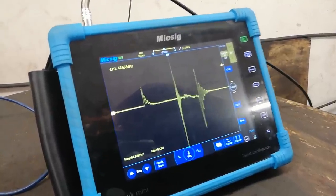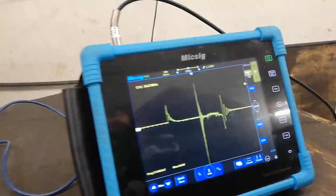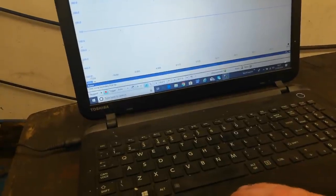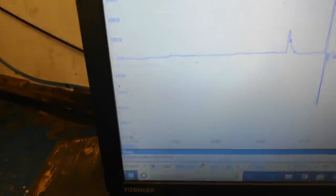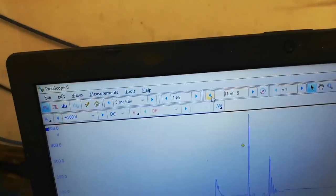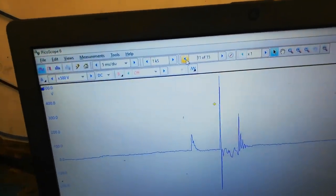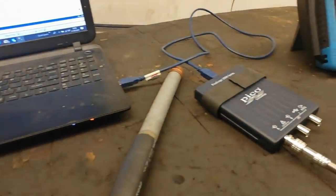It's all in one volt there and it's just measuring 4.6 volts. That's a good capture. The wee pattern was a wee bit jumpy but we'd probably tweak that. Winding it back a lot of frames, going five milliseconds per division - there we go. That's a Pico 2000 from that scope-safe paddle probe.